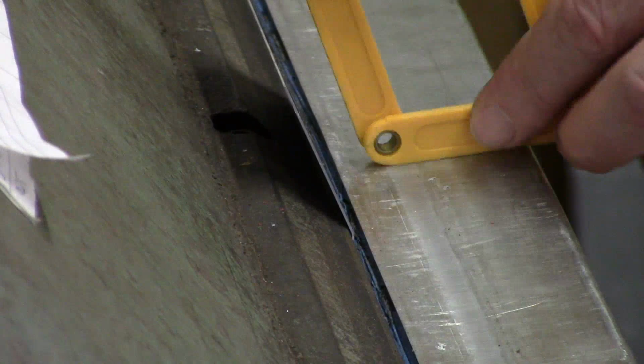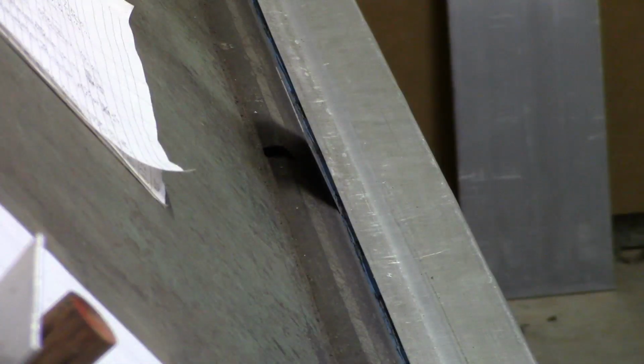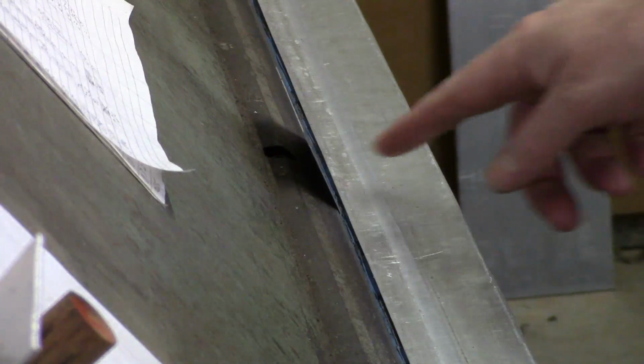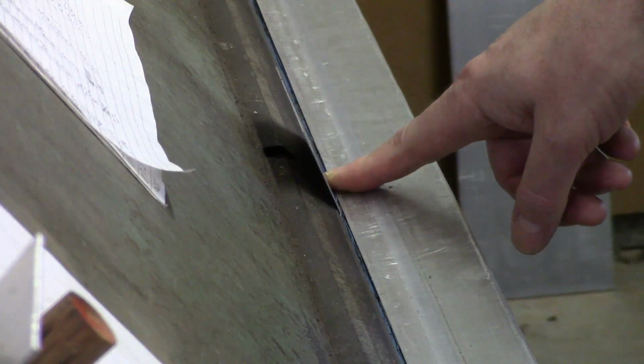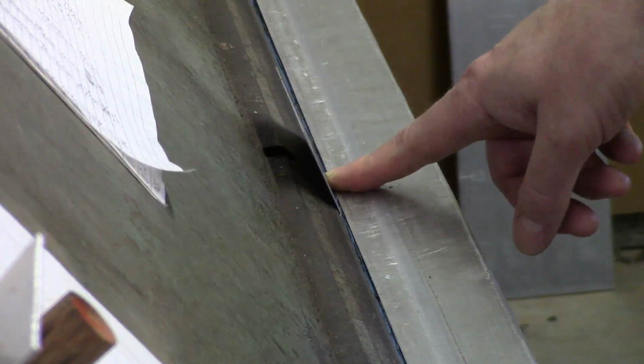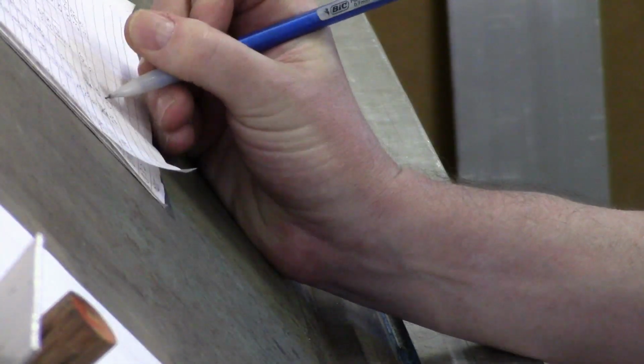We'll take a measurement here and see what we've got off of this part. Zoom this out a little bit, easier to see what's going on. The angle I am currently showing is about 65, which for the way this is set up, I need to add 5 for that. So I'm actually around 70 degrees according to my protractor, so I may have overbent slightly, but for this test profile that's fine. On the protractor we were around 64, I think it was 64.5.